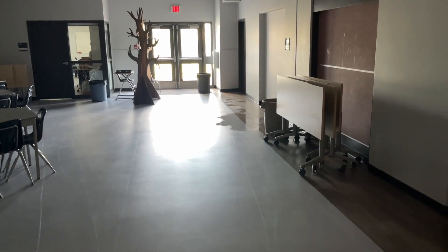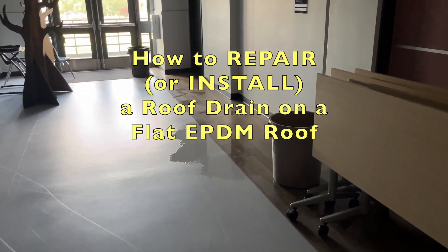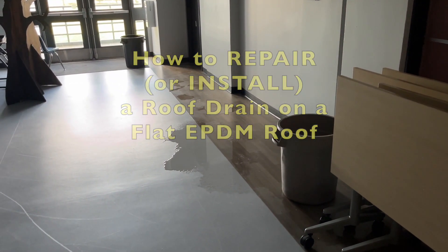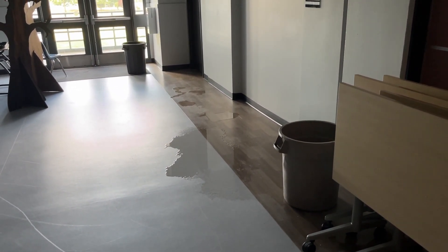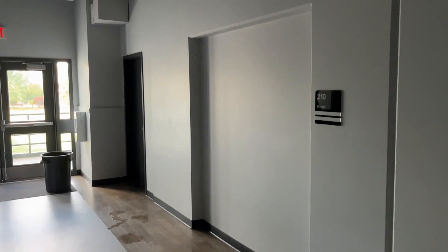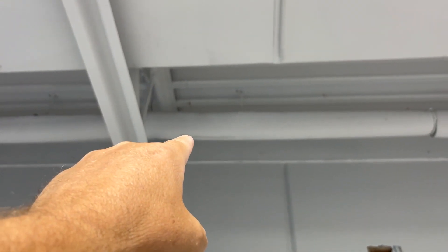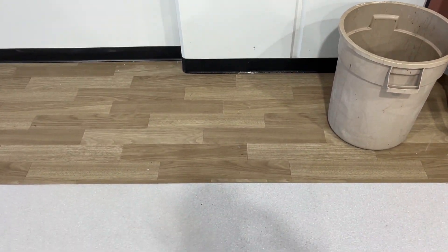There's a roof leak coming from a drain over here, and it would appear that whoever put the bucket there to catch the drips failed to look up to see where they were actually dripping from. I can tell you exactly where it's dripping. You see where the water is dripping off the bottom of that pipe — it's actually coming from the seams right above that, and it's dripping straight down there.